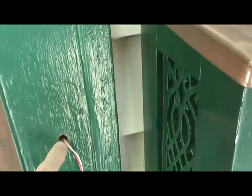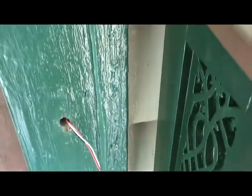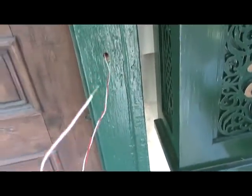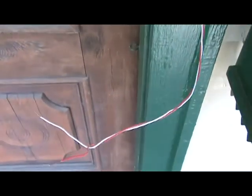At the front door, I was pretty lucky and found the hole, removed the caulk from it, and there was a little tab of the old wire sticking out. I was able to pull that out, get enough of it to join up the new wire to it with electrical tape and twisting it together. Then I pulled the new wire through the hole and that worked great. I've got completely new wiring from here to the transformer. I'm leaving this long since I don't have a button yet — I ordered one and it should come in the next couple of days. I'll stick the extra wire back into the wall so if you need more wire in the future, there's plenty in there. Now I'm going to go to the door and touch those wires together so you can see how this works and how loud it is.